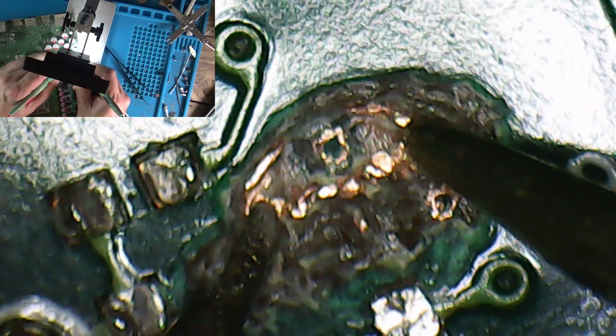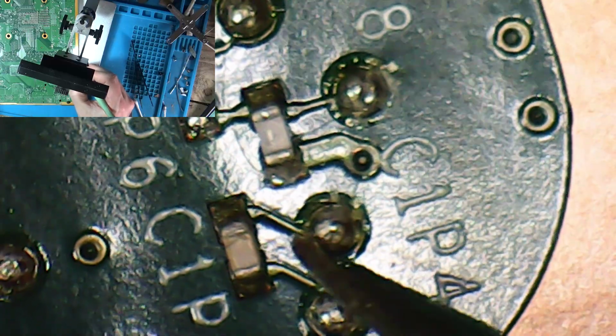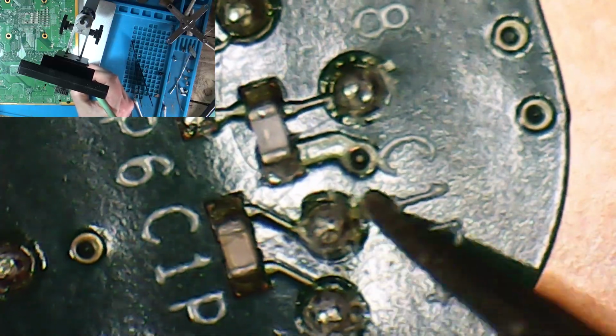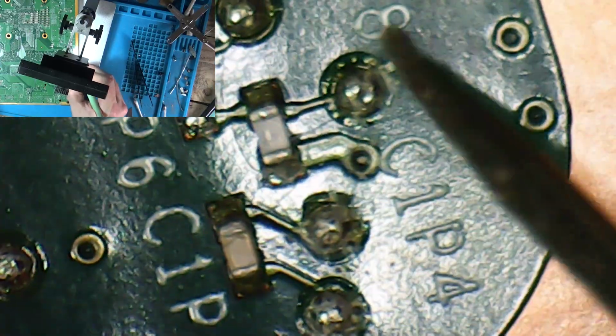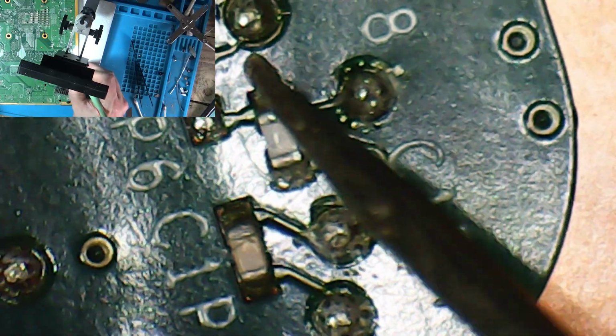I think we can just about see there our 2 other vias. That one is showing shorted to ground though. That one's not. But that one is. Presume that's not meant to be a ground. So I think this is where those vias come through on the other side of the board. So there's no shorts there, but on this via, yeah, short. Which goes through to here, which I'm not sure what this component is.